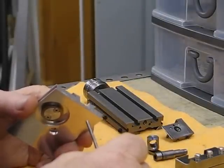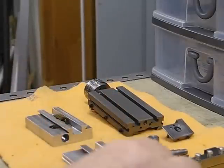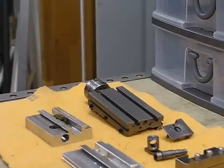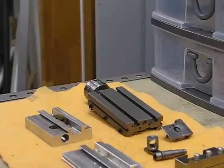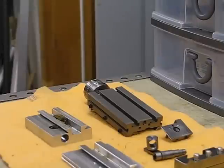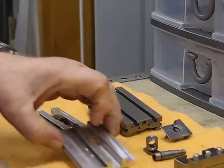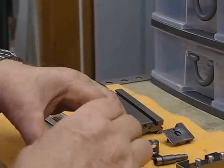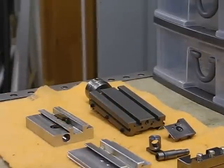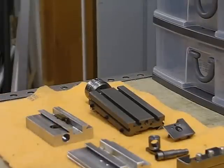They grip around here to stabilize the top slide and stop it from moving, but the trouble is it's so flimsy it's very easy to damage this area inside. I never actually tried it, but I had read in some reports that some users of the Taig top slide had come up with features like placing washers — steel washers, pads, or clamping blocks — alongside each side of the base plate here to stop it from moving when putting a cut on.